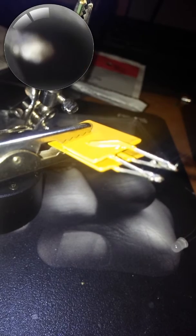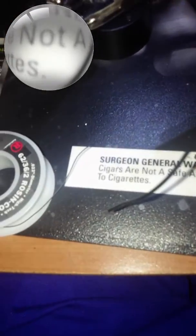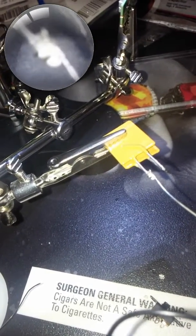So now we got the two 10 amp fuses in parallel. I went ahead and stuck them together — as you can see right here, just went ahead and soldered the ends together in parallel. So the fuse is in parallel right there. You got that wire by itself, and the LED. This one's going to go to ground right here — got a wire, soldered it to ground. And then also this is going to be tied into the master on and off switch, which I'll hook up right now.